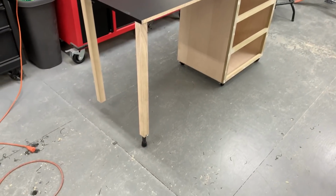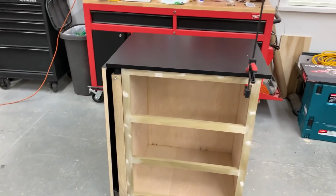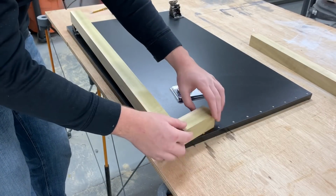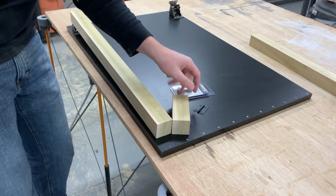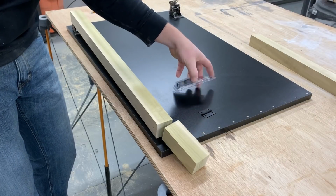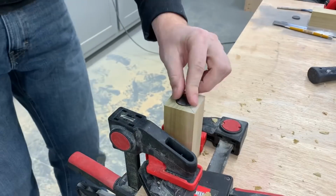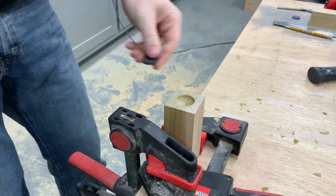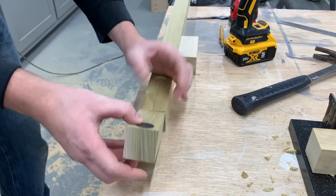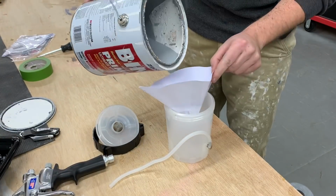This was a decent idea and worked, but I wanted something a little easier for the client that looked better as well. So option 2 was just using a second small block that I would attach with a hinge and then magnets to hold it either open or closed. I knew this route would be the winner, so all I had to do before paint was drill the recessed holes for the magnets. It's always fun tinkering around and coming up with solutions like this, at least for me anyways. With that figured out, I could move on to finishing.